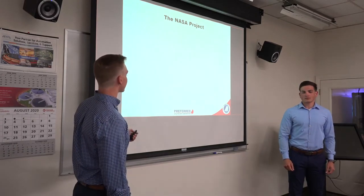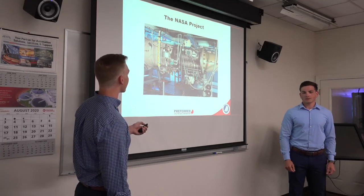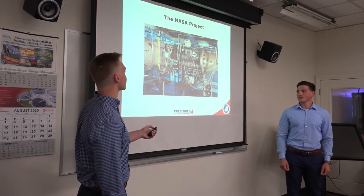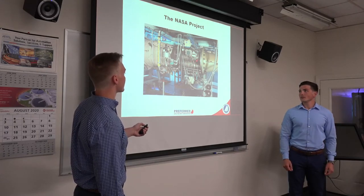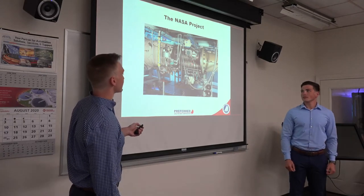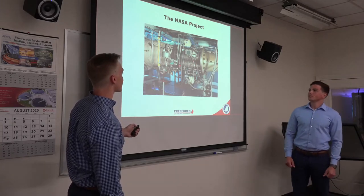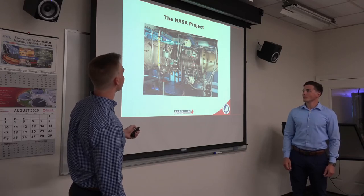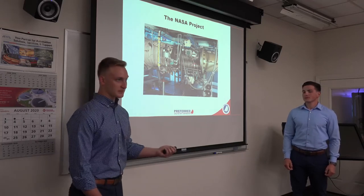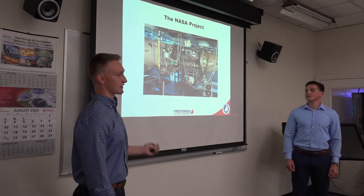So in this burner, in this assembly right here, the flow of oxygen comes in through here. And then there's three chambers right here. There's this chamber, and then another chamber located behind it. The flow of air is mixed with gas that comes from in here and then goes into these nozzles that come in the top right here. And then it combusts in there.